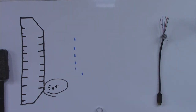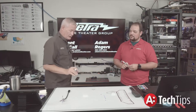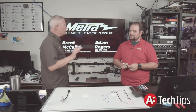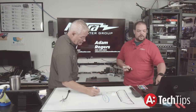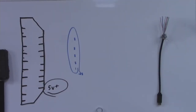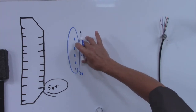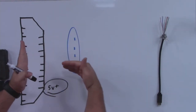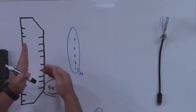Why is pin 18 recessed? The reason pin 18 is recessed is that they want everything else that needs to happen to be physically connected prior to the connection of the five volts. So once the five-volt actually gets connected, all the other ones are already there so negotiation can start. As the cable is being inserted into the HDMI port, all of the TMDS lines, all the EDID lines, everything else is already connected before the five-volt power is connected.